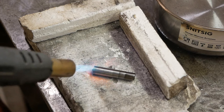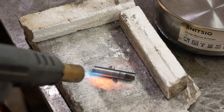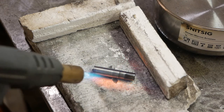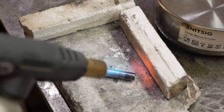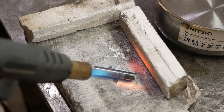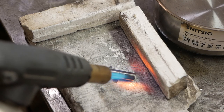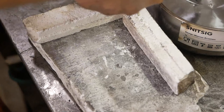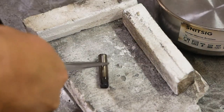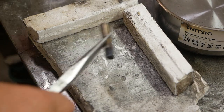So I don't mind if the shaft gets too soft, it's not important. Oh, you know what I didn't do? After I changed the tool path, I never took the second cut, so that's why I've got that mark still in there. I never went down to full depth. It just means I'll have to grind more. Instead of grinding, I left a grinding allowance of about 0.2, 0.3. Whoa. Idiot. Not watching what I'm doing.